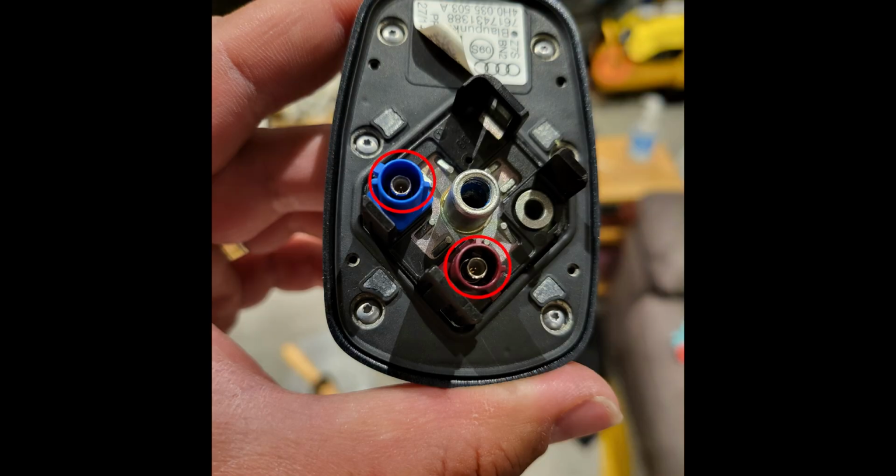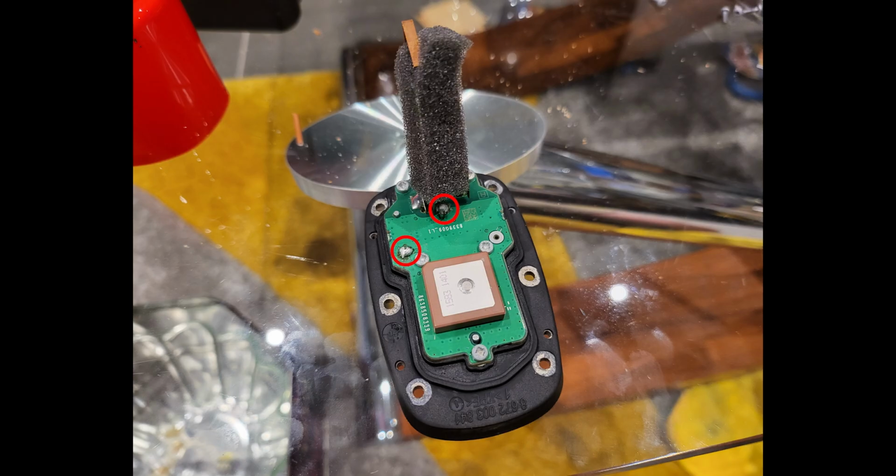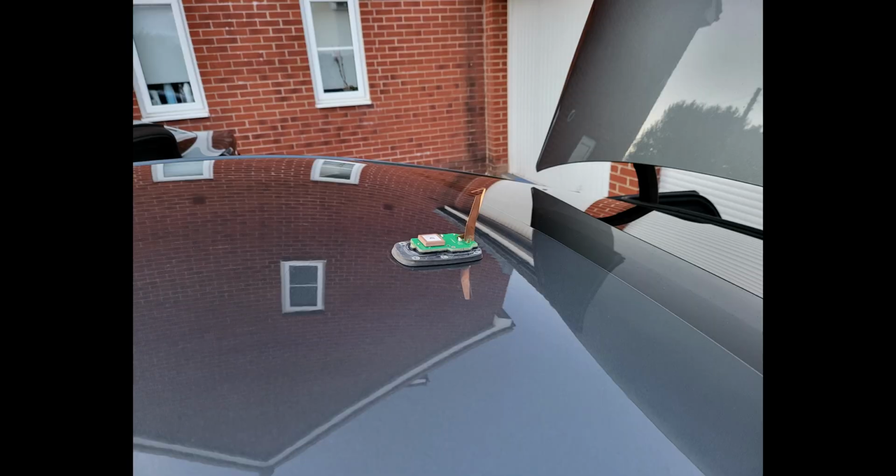that's underneath, they basically go up through and they solder to the PCB. Well, the PCB came off in my hand, right? So there wasn't really any solder holding it in. I thought, that's interesting. I wonder if the connection was bad. So I very quickly reflowed the solder, and I put it back, and then I just put it into the roof, as you can see there, just to see whether or not it would actually do anything.